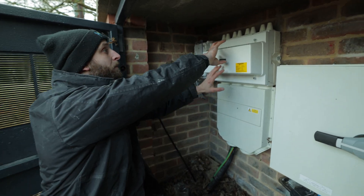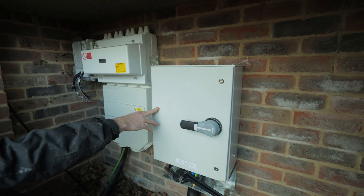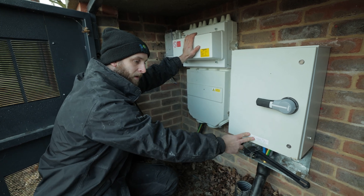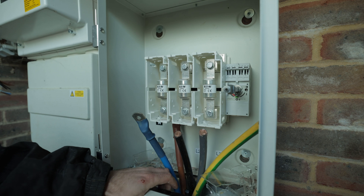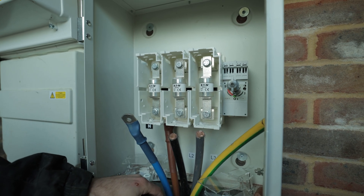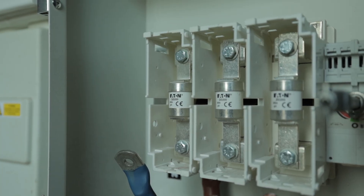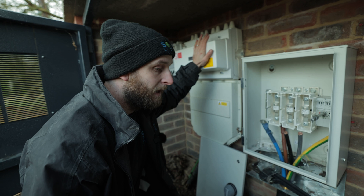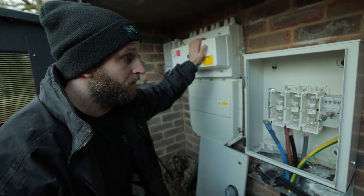We're going to have 70mm cables coming from here, and then because of the volt drop — we're probably about 50 metres away — we've got our 70mm into here and then we upsize it to 150mm to our electrical room. Three phase basically means in simple terms we've got three supplies coming into this property — we need more power. We've got this fuse carrier here because our electrical room is going to be more than three metres away, so we have to put our own fuses in because we're not allowed to rely on the DNO's fuses.